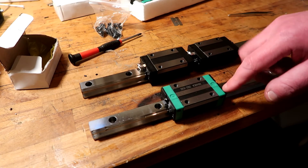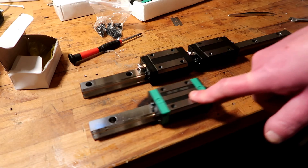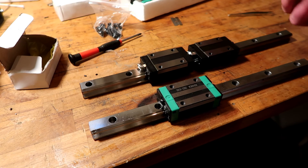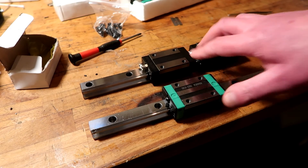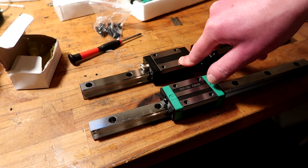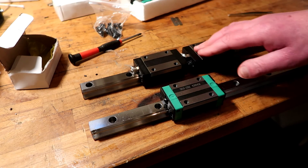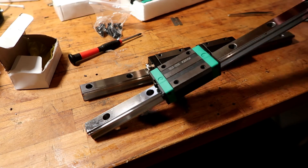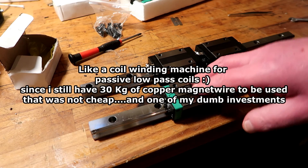So there are completely different carriages also sold as a THK replacement which also fit the HiWin — they don't state that, so I'm not sure if it's supposed to be possible, but by the looks of it, it is. I've seen some websites that say certain THK products are interchangeable with the HiWin, and this appears to be one of them. I'm waiting for my new dial indicator base and arm, and then I can measure if this one has more play than this one. If not, these run way smoother, so that's already a win. I might order a second one, and this one will go — not in the bin — maybe for another machine I don't care much about.